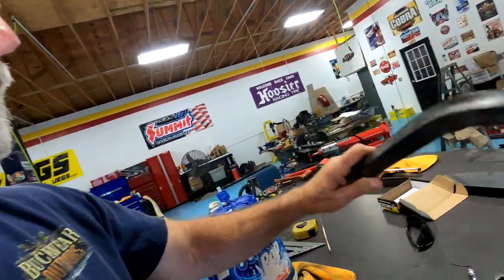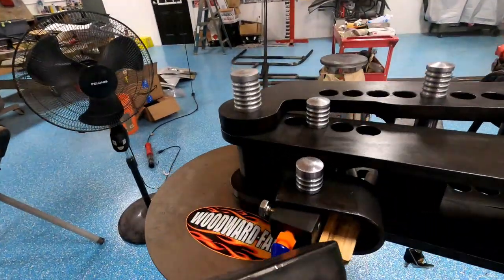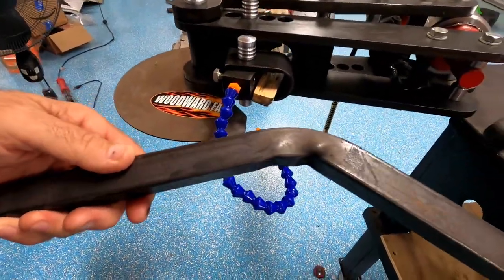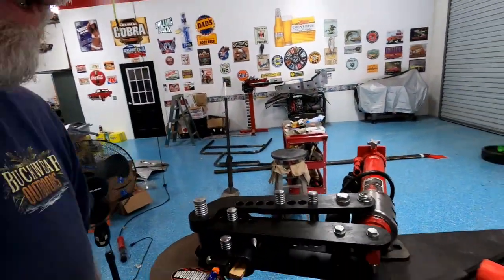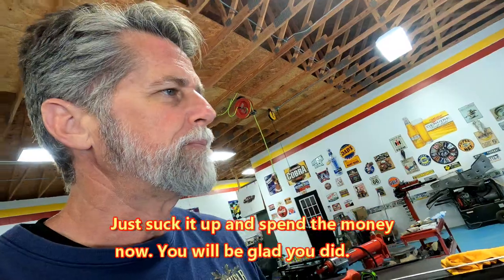Then I thought, well, what's really happening in the pipe bender is the pipe was slipping some. So I put the piece of wood in there, really got her tightened down, and we got that kind of bend. So it was closer. And looking on the internet for square tube pipe bender dies, I found some for the 1 inch. They're over $300. I just need one pipe. Yeah, I might use it later for something, but for now we're going to do it a different way.